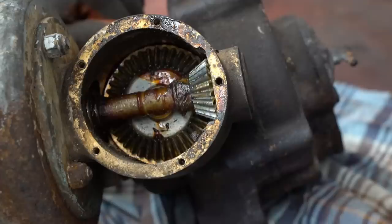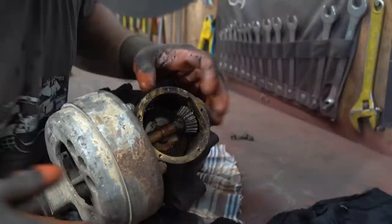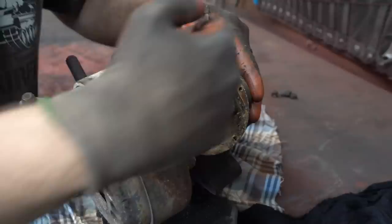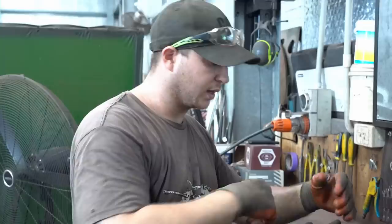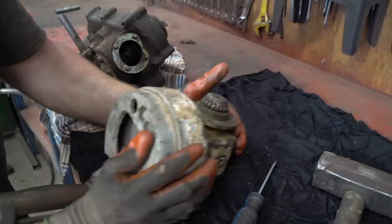And so this traverses the turret? Yeah. This handle here has a shaft that goes up through it, which is this gear here. So as I turn that handle, it turns that gear, which turns this internal gear inside. On the other side of it, when I pull this off, you'll actually see there's another gear on the other side, which goes into the housing, which turns another gear. So turning the turret manually, it's not a strenuous task. So that moves that.